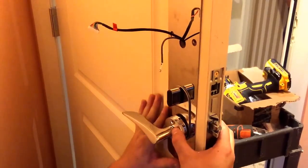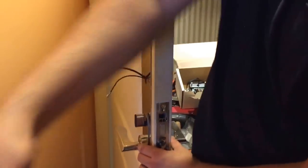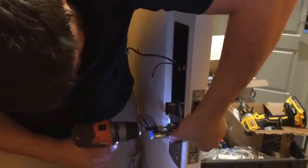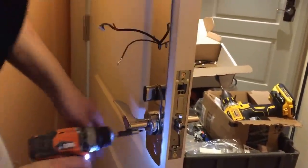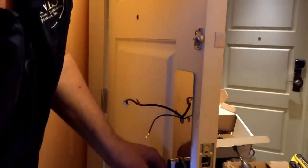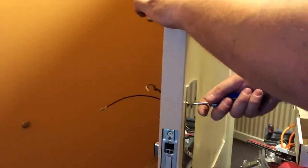Line these two shapes up and go like that. If you can't get it to go in, just wiggle it, adjust the plate, and it'll pop on. The hardware pack comes with four screws — two long, two short — and you want to use the two longer ones. If you're not hitting the hole, twist it one way, then the other, to find it. Also, if you tighten one too much before tightening the other, you're going to bow it. So leave it a little loose so you can adjust the cover plate and straighten it out.